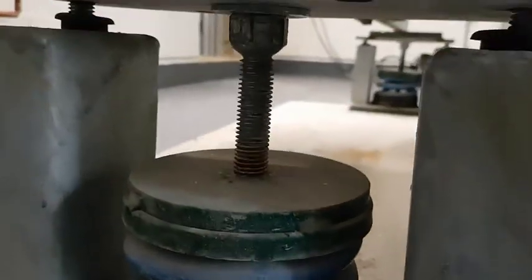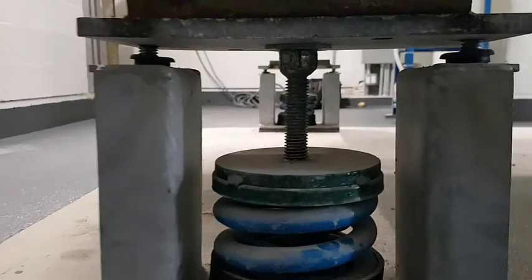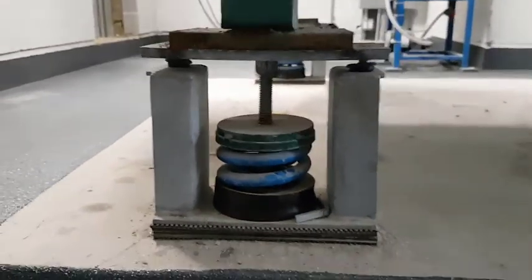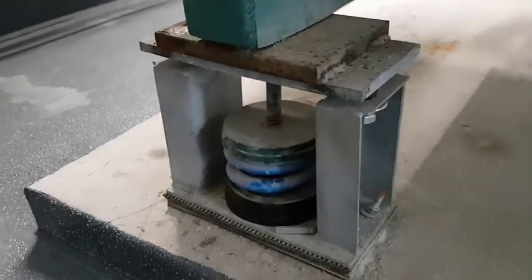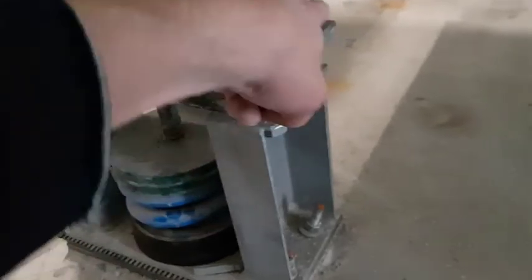A quick look at the leveling bolt and compression cup shows markings on the nut, evidence of adjusting the load onto the spring. In general, it seems to be okay. Taking a look at the connection to the top plate, we find a couple of fillet welds at each corner, meeting the requirements shown on our installation instructions page.